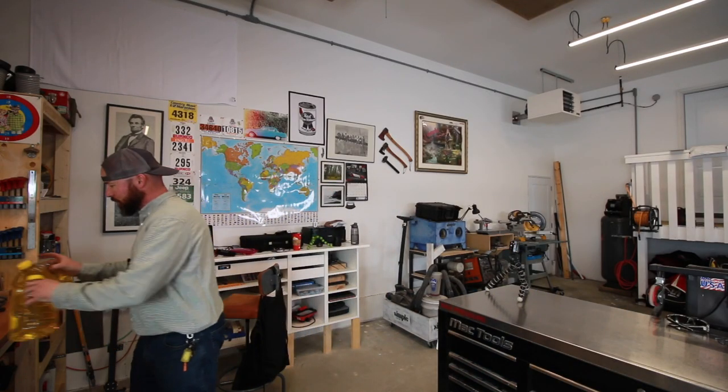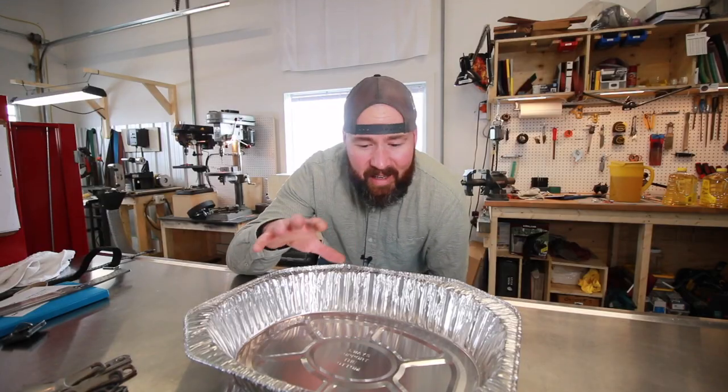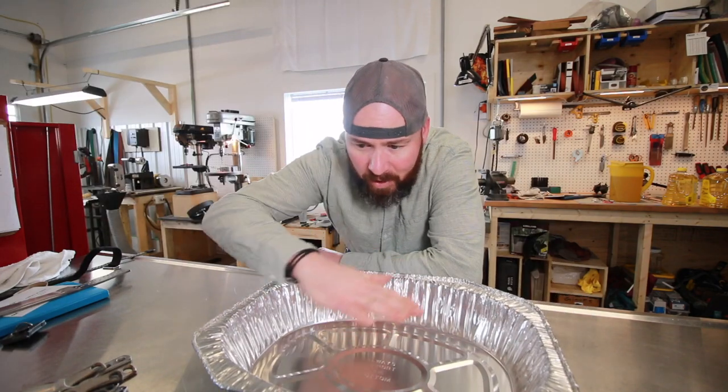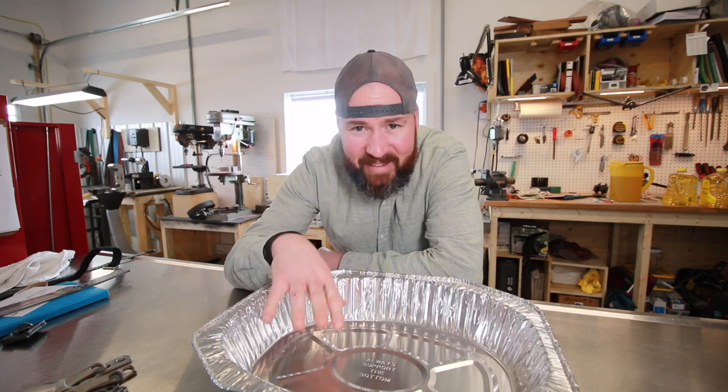6 liters of canola oil. And I'll tell you one thing, desperate times require desperate measures. Now, I couldn't find any containers big enough to put my blade into at the dollar store. So hopefully this will work. I'll fill it right up with oil and then we'll stick it in here, give it the one-two swisheroo. I should be able to get a decent heat treat on it.